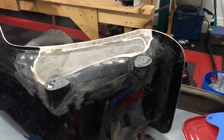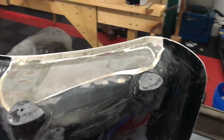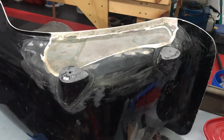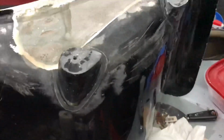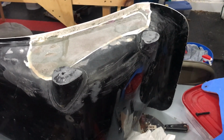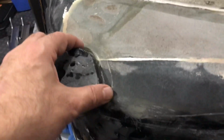All right, so here's the last work in process. I got the mold off the front piece there. The screw came out without a problem. I actually put a little wax on it, so that helped. That's another best practice, but all in all, I mean, it looks like a bit of a mess, but this thing will clean up really easy. You know, ultimately, I'll sand these down, I'll prime them, and I'll probably paint the back and upholster the front and the side.